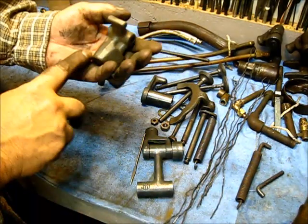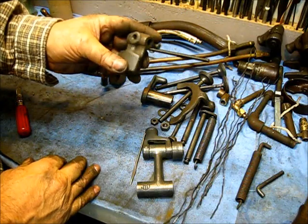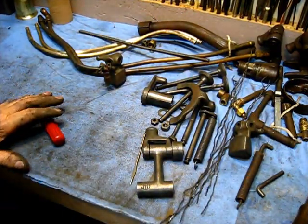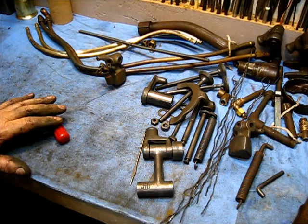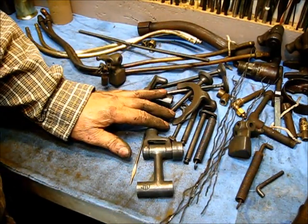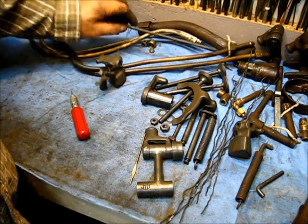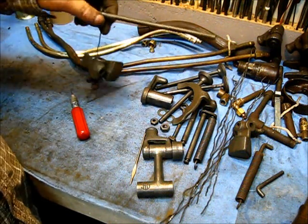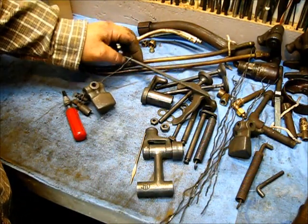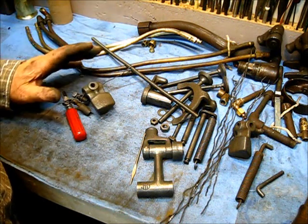This one here I just took from the tank and water-brushed it, so it's good to go. It's one of those processes — if you have tried electrolysis and it didn't work for you, do a little studying on it and give it another try, because it is cheap, it works, and you'll save some parts that you didn't think you could save.